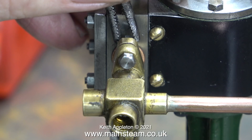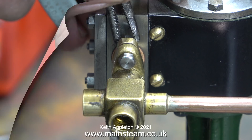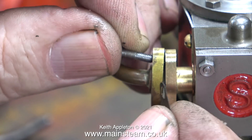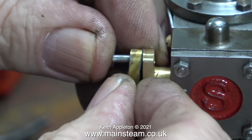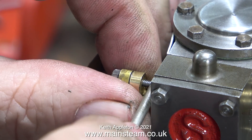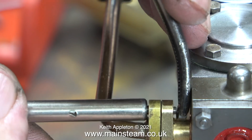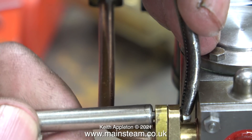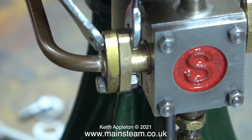This is a job I wasn't looking forward to. It's not particularly difficult, it's just very fiddly. Here I'm fitting the steam inlet piping to the flanges that are screwed into the steam chest. With the help of a small pair of surgical forceps, a nut spinner and a couple of spanners, one end of the steam piping was secured to the flange. This is the other end and as you can see it looks to be horrendously out of alignment, but don't forget this is very soft copper piping that's been kicking about in a box for quite a while. After not forgetting to fit the gasket between the two parts, using the same method, this end of the steam inlet piping soon aligned with the flange on the steam chest. I'm holding the nut in place, eventually I get it at the right angle. I'm using a nut spinner to rotate the bolt. Once it grabs, I then tighten everything up using two spanners. These are only 7BA bolts — do not over-tighten them.